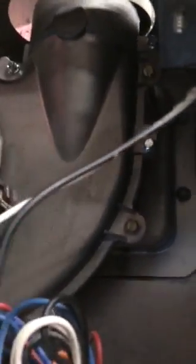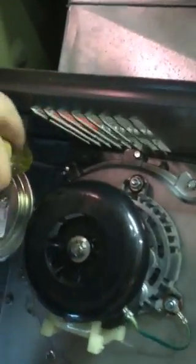Okay, so let's give it a slide. Okay, so make sure you put these nuts all on tight and make sure they're even, because you don't want this motor on an angle, okay? Because you can actually bend the housing. If you do that, then it'll make even more noise. So remember, there's four screws here on this one, okay? Now the original motor that was in there was a Fasco, okay? It's no longer a Fasco. Okay, put your pressure hose back on.